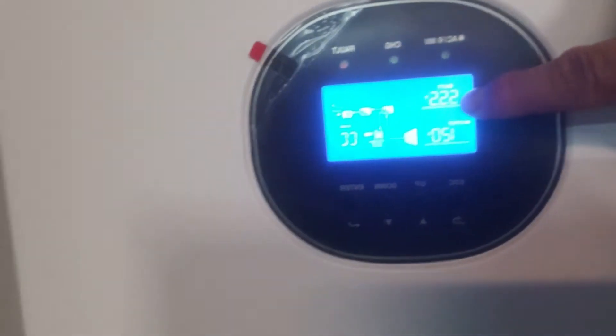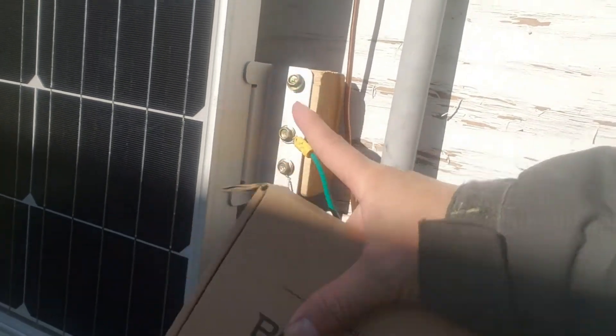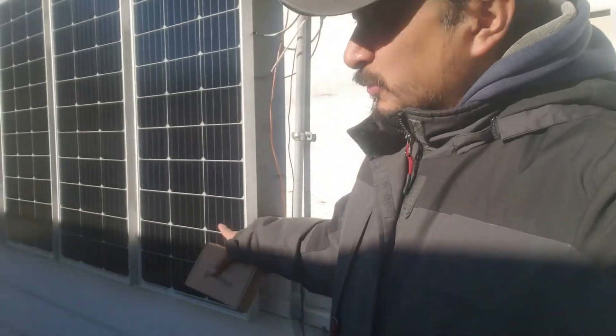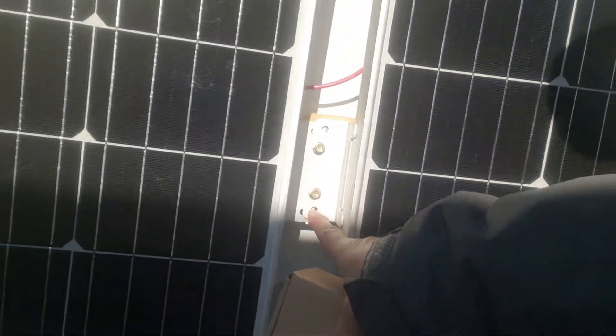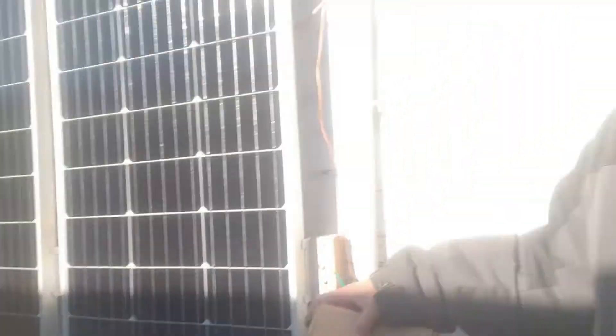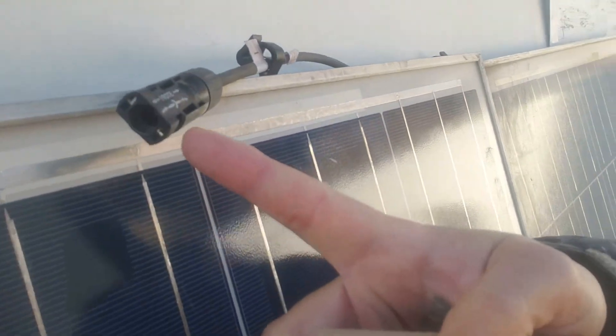So this is at 55 volts. I'm going to start making my clamps for the solar panels. Now when you buy solar panels, they don't come with mounting clips — you just have holes on the back of your panel. You have to buy the mounting clips separately, and they normally come with screws. These are sheet metal screws that I screwed in and made the holes where I needed, and I also grounded everything. It's just one ground line because all these are overlapped, so if I get a lightning bolt or an arc, everything goes right into the ground.